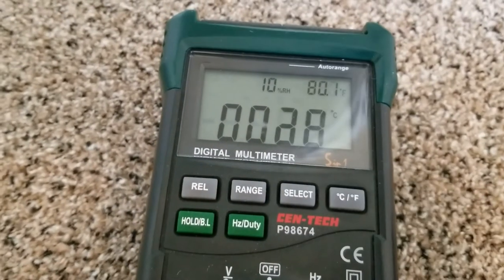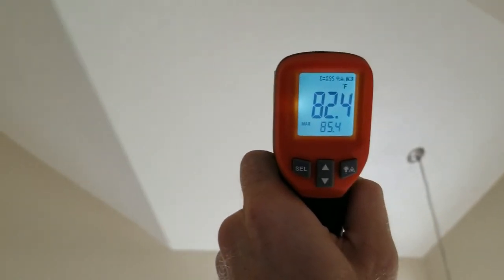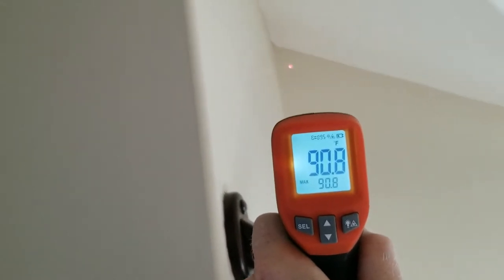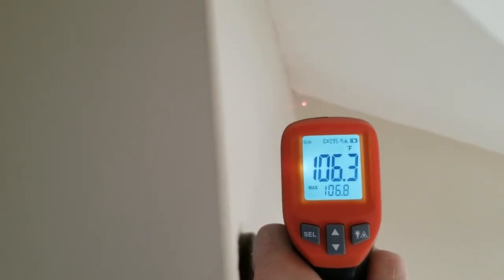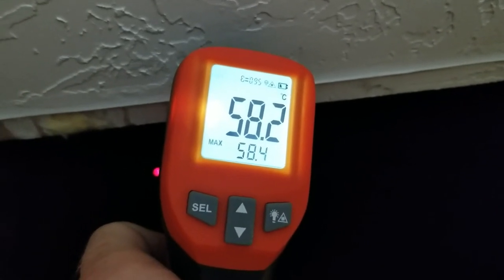My air conditioner has been running all day long. Here inside the house, it's about 74 degrees Fahrenheit, which is about 22 Celsius. Now even though my house is well insulated, there is a lot of surface area of my ceiling, so even a small temperature differential between the attic and the rest of the house can amount to significant heat transfer. Here I am taking a few temperature readings of my ceiling — it is a little bit hotter than the house in different areas. But pay particular attention to this wall here, which touches the attic. If we go up to this top corner, you are going to see that it is 106 degrees on the inner surface of my house. And here is a sample of the attic — as you can see, it is 136 degrees, which is about 58 Celsius. Pretty dang hot. Now consider that it is 7 o'clock at night. Think how hot that attic was 4 or 5 hours ago when the sun was coming straight down on top of it.